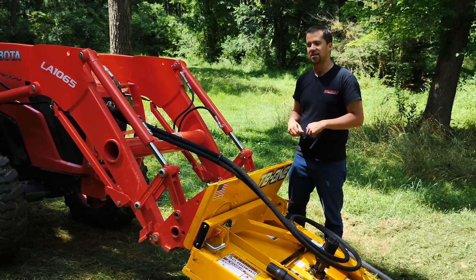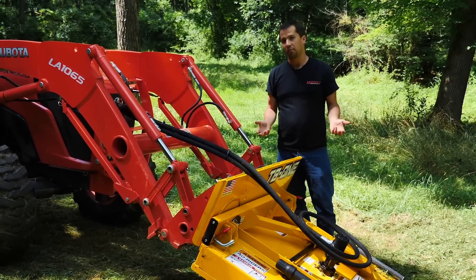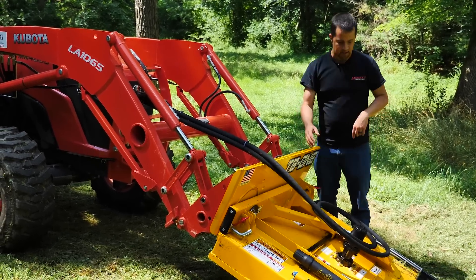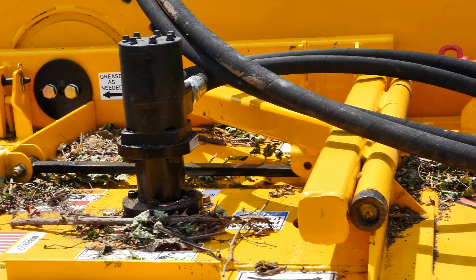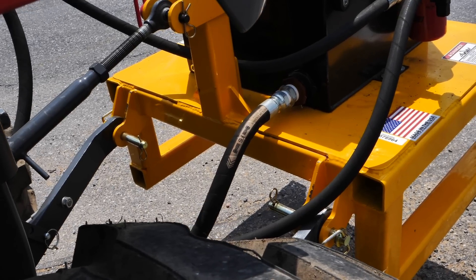It's also really nice that it's on a skid steer coupler. Very easy to drive up, throw your two levers to lock it down, and off you go — no fumbling around with your three-point hitch. That's a big pro. Driving the thing hydraulically is a really interesting concept. It has a nice small Eaton motor on the front and simply just takes a feed and a return in order to power it. We'll talk through how these hydraulics are plumbed a little bit later.